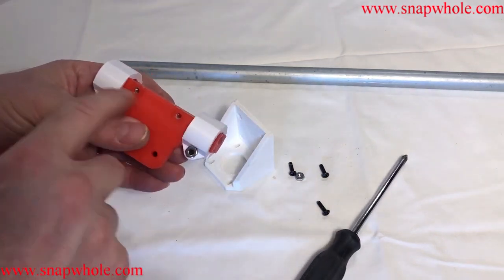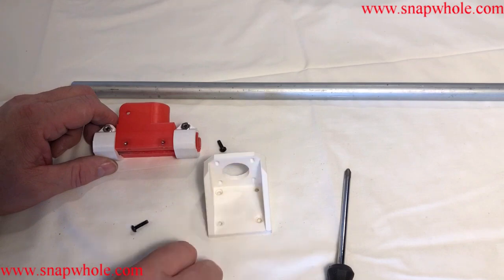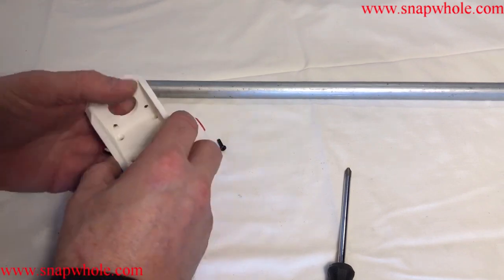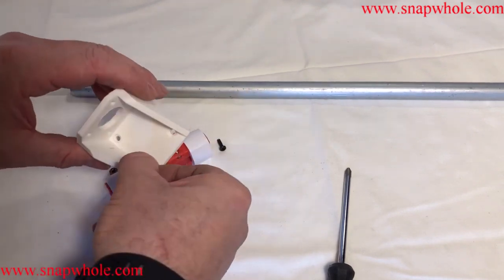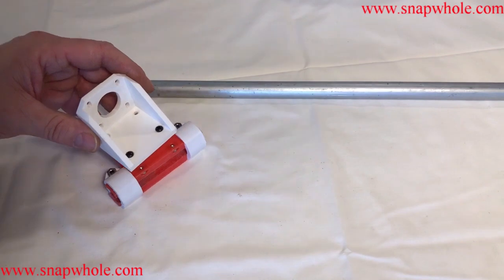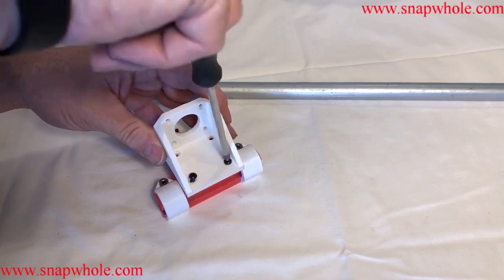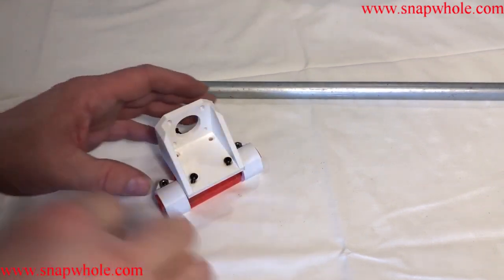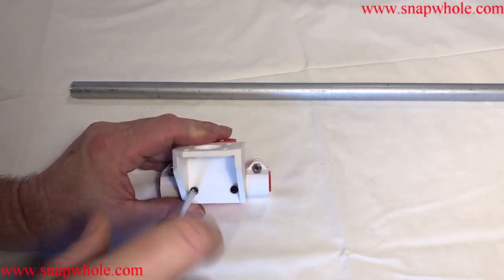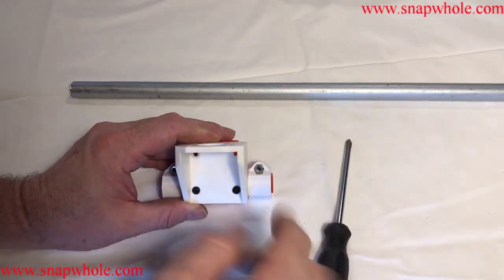You can see the nuts almost line up — adjust them as you go. Now that I've got it together this far, I need to put on the Z motor mount. Orientation-wise it goes flat side up, so I want to set it on there, put in two screws going into those nuts. You can use your fingernail to adjust the nut. Tighten those up — not all the way but tight. When we do the final assembly to the conduit we can tighten everything up.